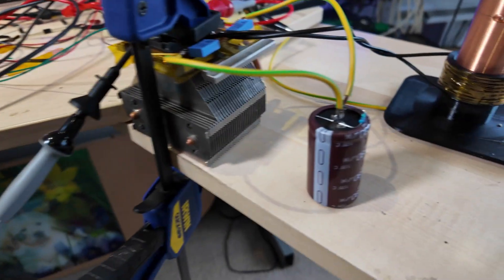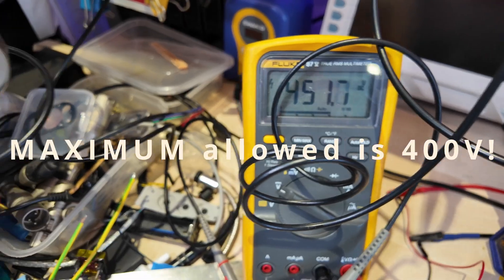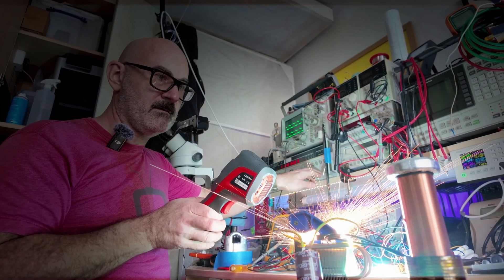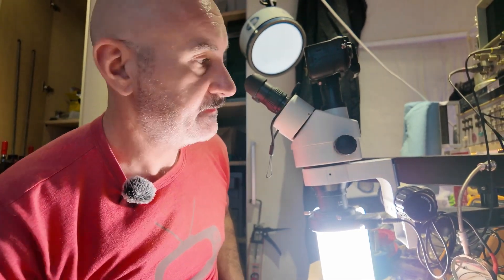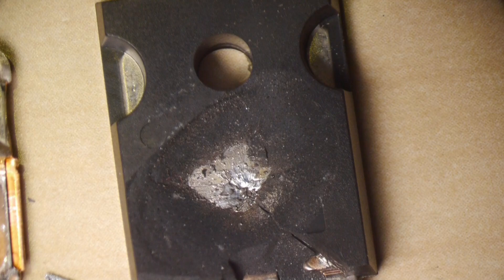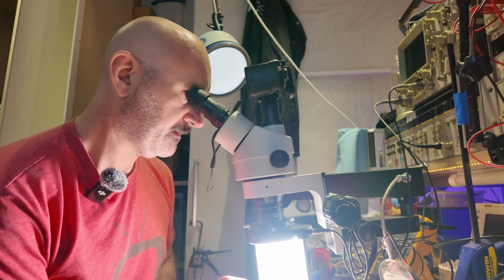Part of the problem was there was too much voltage on this capacitor as well — this capacitor still has 452 volts on it. Absolutely lethal. Why is it so high? We can actually see here where the explosion happened, right in the silicon chip inside these massive MOSFETs. You can see the crater where it exploded right there. They've actually picked apart the other one — there's a piece of it. Very shiny. Fascinating.